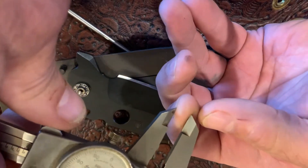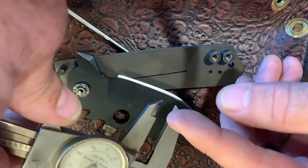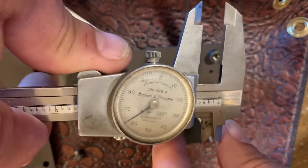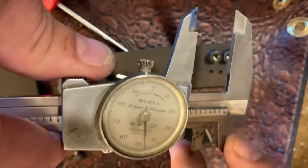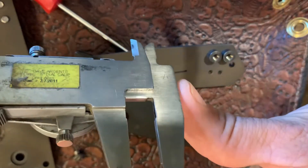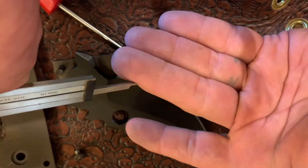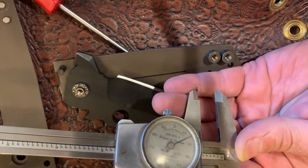The precision edge is between this bevel and this tip down here. You can use the upper part too, but this is what these calipers are designed for. You also have another point here — this one is for measuring ODs, over here is for measuring IDs in the opposite direction. You can also use calipers for depth: if you have a surface and you're measuring off that surface, you bank the end and measure the depth. So there are a few ways you can use calipers — that's the first tidbit.